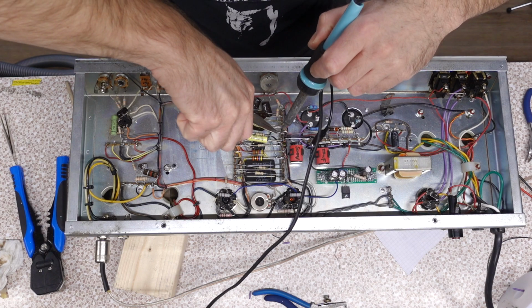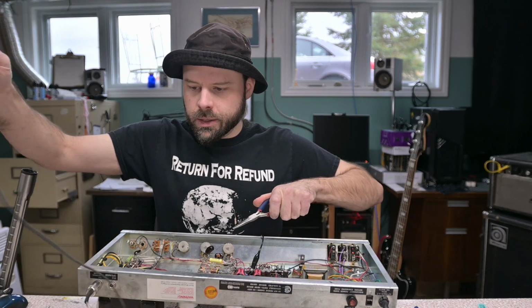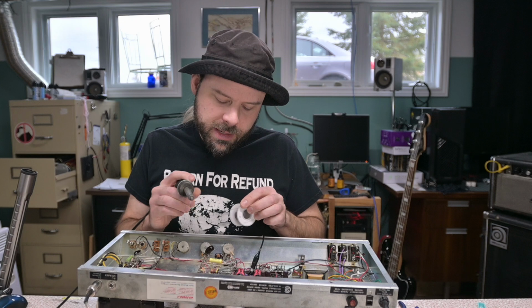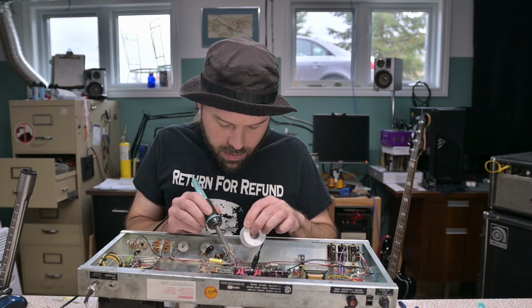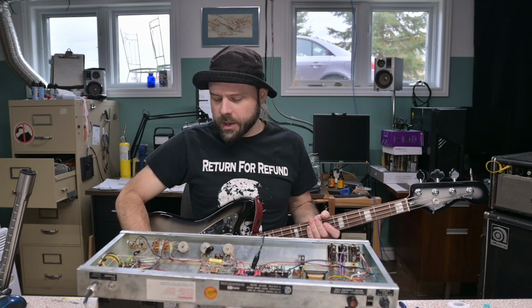But we need to detach this capacitor. Come on. Yeah. So something like a 470K, I think. Alright, let us insert a resistor. Oh, we'll just tack it on here for now. Now, the fact that this thing sounds identical, even though I've done all these mods, means we could probably resimplify this situation. All right, blocking resistor in place. It blocks excess current from hitting the grid.